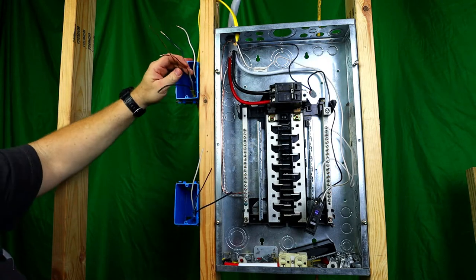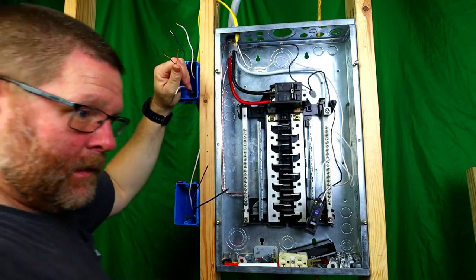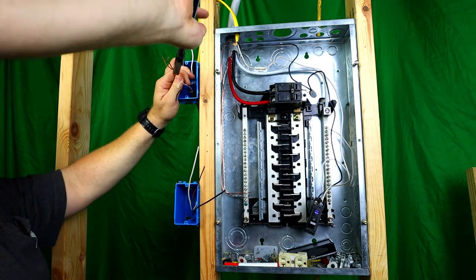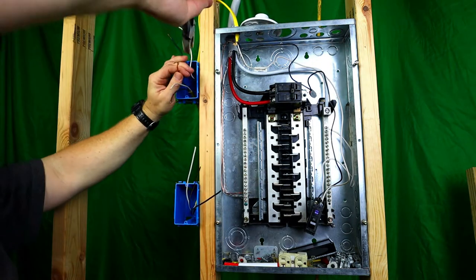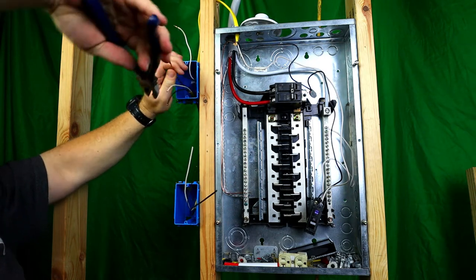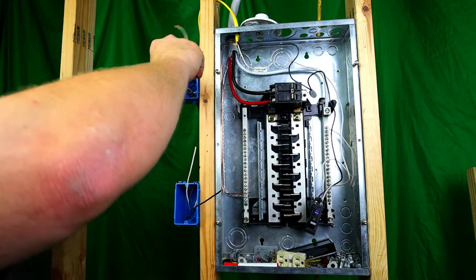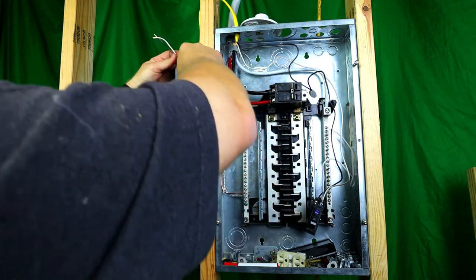What we're going to do very first and foremost is we are going to twist these together. Now, I said I was going to use the Wago connectors, but I'm not going to — I'm going to use wire nuts, just because. For this particular light that I'm using, it's just a keyless fixture, so there's no grounds on here. What I plan on doing is just twisting the wires. Remember, six inches from the back of your box, guys. I'm going to put a wire nut on it, just like so, and put it in the back of the box.